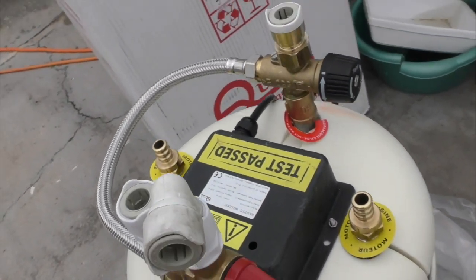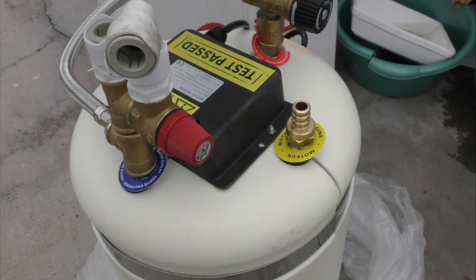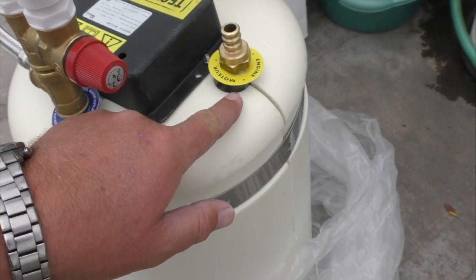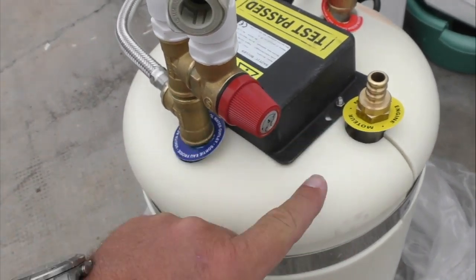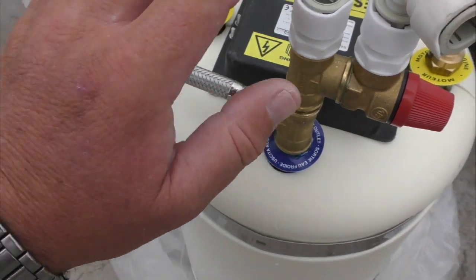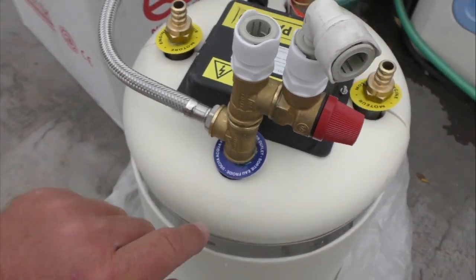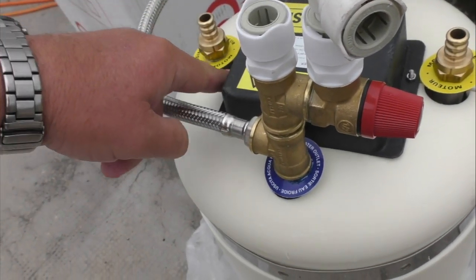But the reason that it's gone is because if you lift the cylinder up by the tubes, you can see there's a gap between the insulation and the tubes, and what's holding this cylinder up inside this insulation at the moment is one M4 bolt there and two there. So if this gets hit on the end, it pushes that down, which forces these two welded and this welded stud down and breaks off the plastic here.